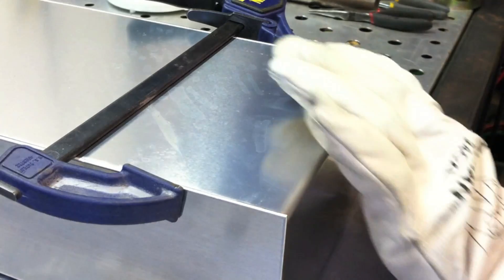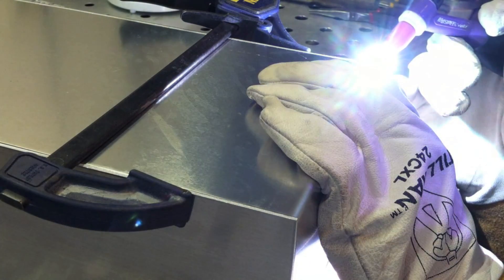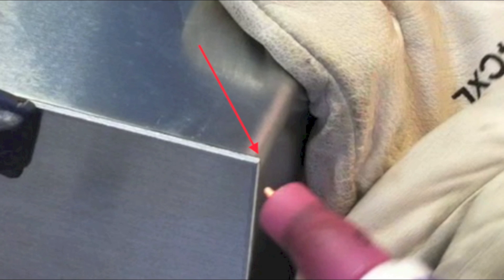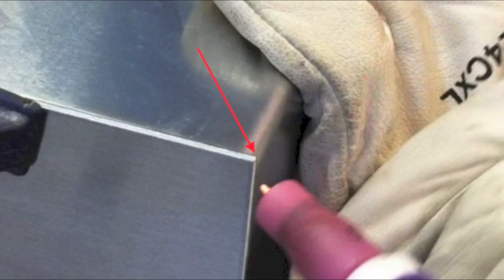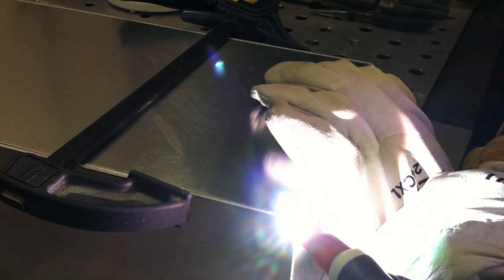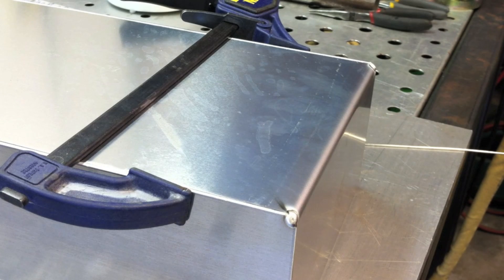For building a box out of sheet metal like this, you need a lot of clamps and they don't have to be made for welding. A carpentry-type clamp works well for sheet metal as long as you keep it far enough away from the weld. Generally you want to tack with filler metal, but when you're working by yourself you sometimes have to tack without filler. Having a corner like this to melt for filler helps — there's a little radius in the bend but the other piece is square cut, so there's a little corner to melt over and use as filler metal. Without filler metal, your tacks have a chance of cracking on aluminum.